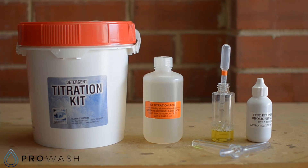The different soaps across the automatic and self-serve car wash will have different recommended titrations. For example, this tyre cleaner is set a lot higher than, say, a foam brush. If you contact us at ProWash, we can give you recommended titrations for each function across your wash. It pays also to check these titrations regularly, as a change in titration can be an early indication of equipment issues. If you've got things like faulty diaphragms in your Hydrominders or solenoids, or faulty injectors, these can all get shown up by titration tests.